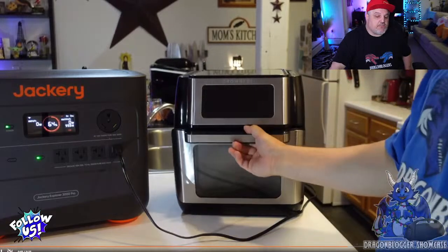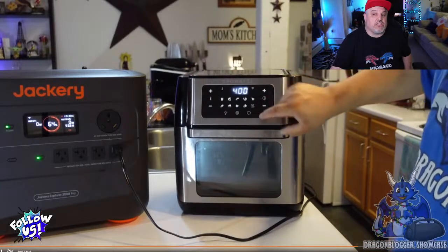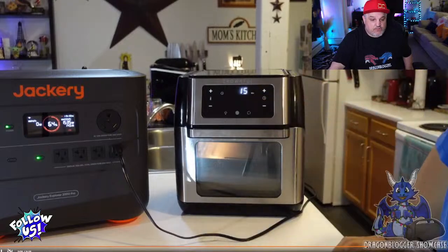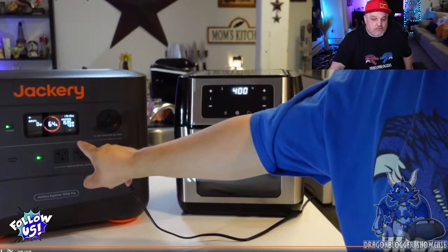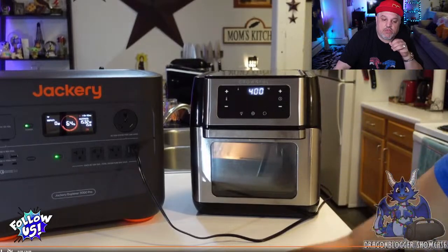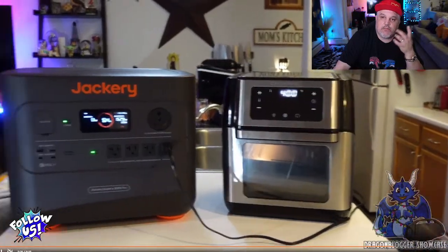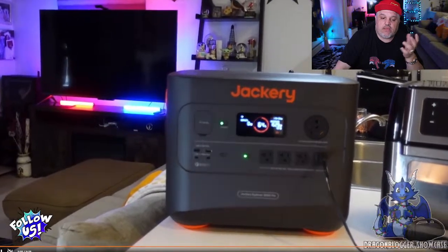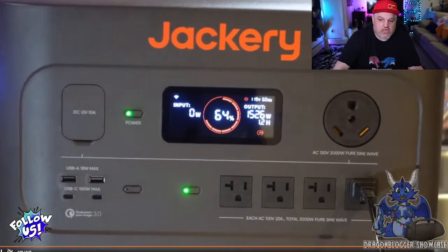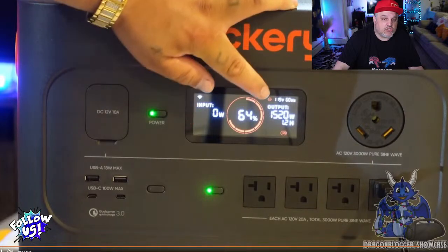Charging off six of those solar panels takes about three and a half hours; you're getting two in the kit, so expect around seven to eight hours of charge time with two panels. You can use it technically as an emergency power supply — it takes about 20 milliseconds to switch over, ensuring continuous power. The one thing to note is the device you want to protect needs to be plugged into this unit already. It's a great piece — I love these stations and use them quite a lot. It works with an app on iOS and Android, so you can turn it on and monitor it remotely.